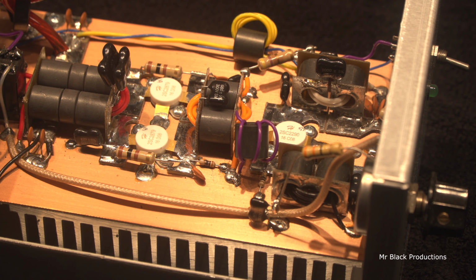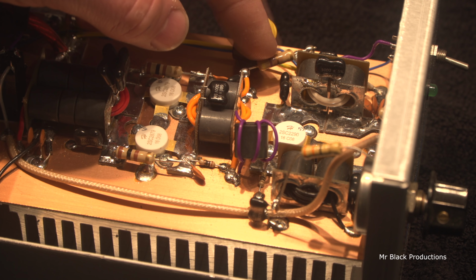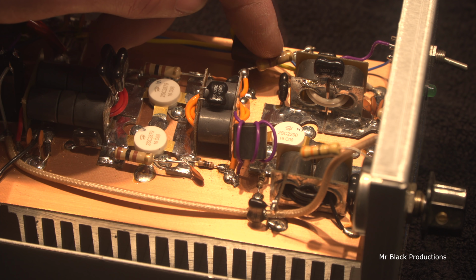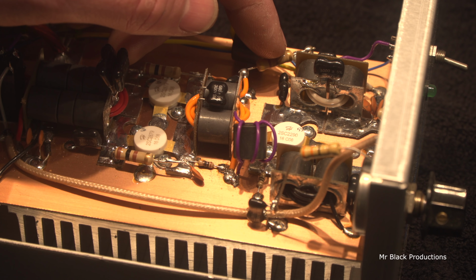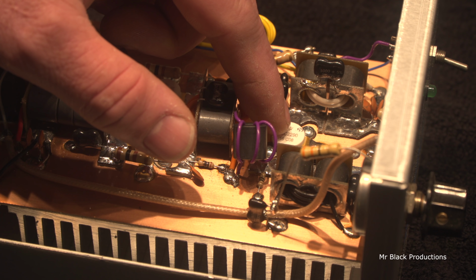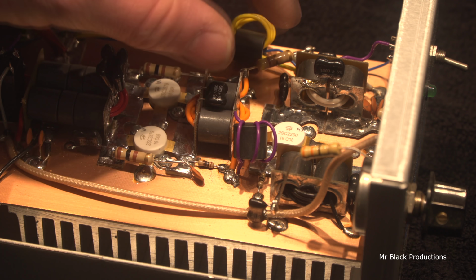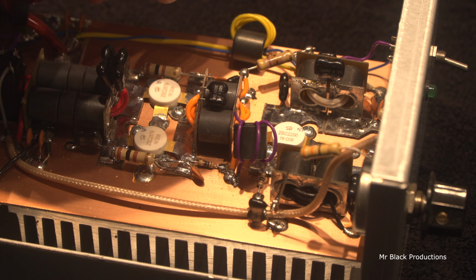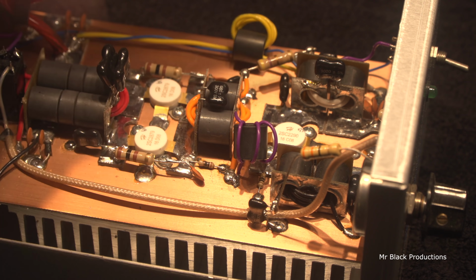So now that you've had a few minutes to digest what we're looking at, your eyes have probably wandered up and they've picked up on this little visual cue right here. This resistor is not bad, but it's a little warm. It's been warm. And that means that we've been driving the piss out of this transistor. So this transistor's jumping up and down for all mites and joy and God and country. And it's just a hair too much drive for these two transistors, and it's backing up here to this resistor and it's getting hot. So we're going to leave this alone for right now. We'll come back to it later.